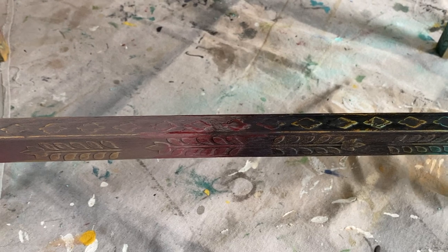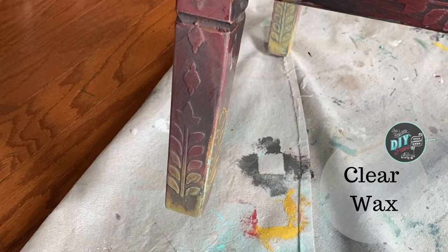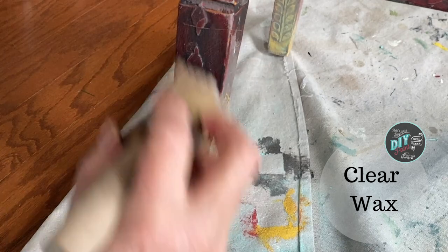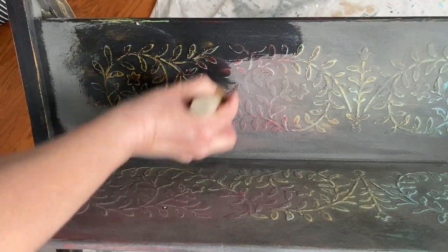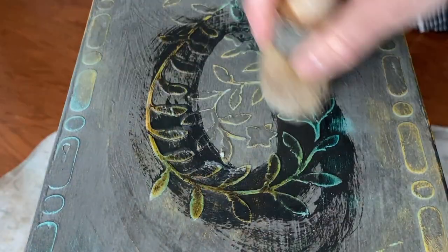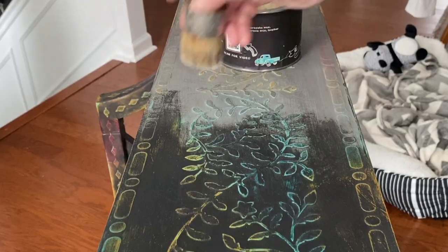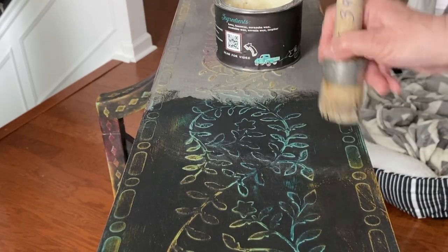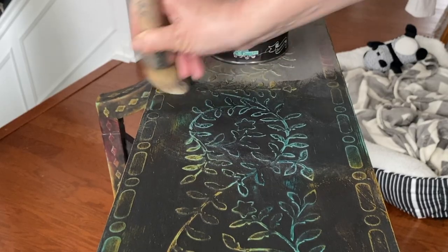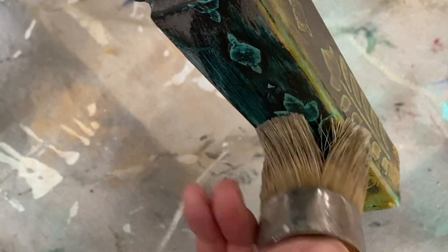Check out the way the paint comes to life with the wax. I'm using DIY Paint Clear Wax — you can see how it really wakes up those colors and makes them so vibrant. You can also use other top coats like Big Top or another brush-on water-based top coat. You definitely want to make sure you use a top coat on your DIY paint, not only because it wakes up the color, but because DIY paint can be reactivated with water for quite some time. Plus, you just did all this work — you want to make sure everything is protected.